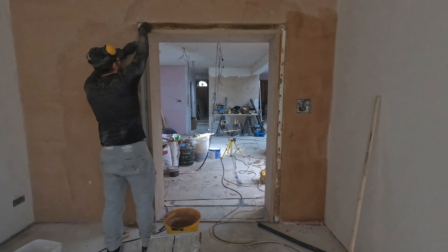Next day - everything is prepared for plastering. I've set up the beads yesterday. We've created the shadow gap now around the oak frame. Now I just have to plaster it. I'm obviously going to masking tape the wood - I don't want any plaster landing on it. It's been lacquered a couple of times but that's not enough; the water will still get through. The plaster is very acidic, so it can create black stains in the wood. That's why I'm going to tape it off.